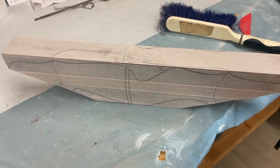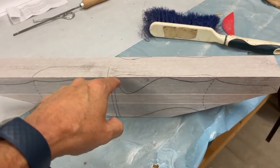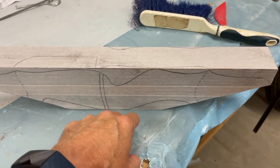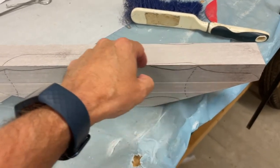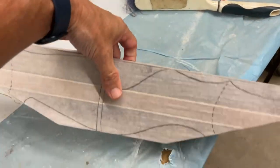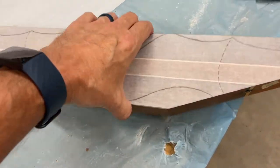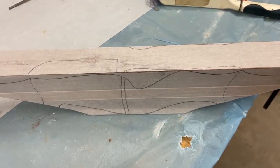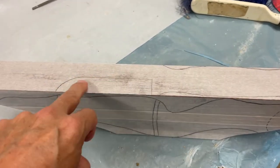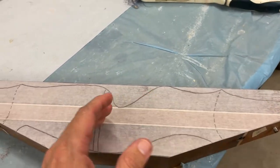You have to plan how you're going to cut this out. For instance, I was going to run it through like this first, but if I start cutting here I'm going to lose my detail in here — I'll definitely whack this piece off and won't know where to cut. So you've got to plan this out. First thing I'm going to do is these cuts right here because that won't impact anything from the design — that gets the bottom piece off. Then I'll cut down and make the cuts to get the riser piece out, flip it over and finish up, and I should still be able to see my lines.